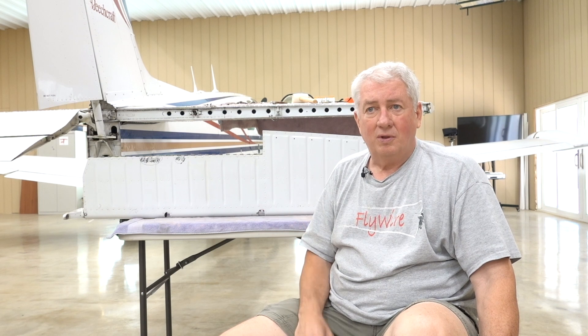So you strip it like normal, but then you want to do a conversion coating on top of it, because doing an etching primer doesn't work well with magnesium. You do a conversion coating that replaces the etching coat we're familiar with on aluminum. By the way, aluminum is subject to filiform corrosion too, but it doesn't happen often because in most aircraft applications we allodine — you etch and allodine the surface — and that prevents filiform corrosion pretty effectively. But in magnesium it's a problem.